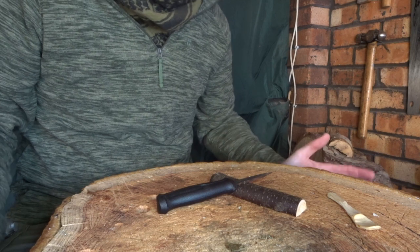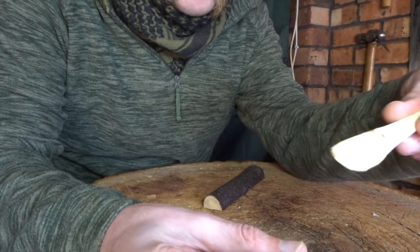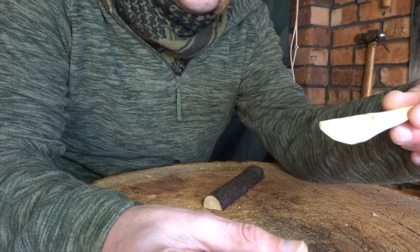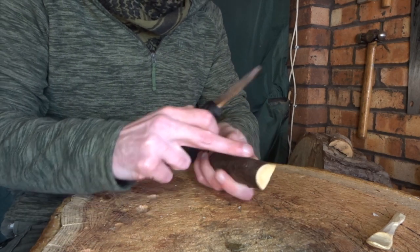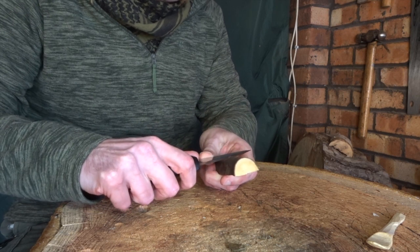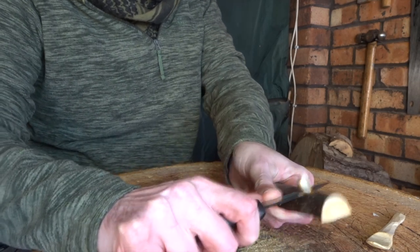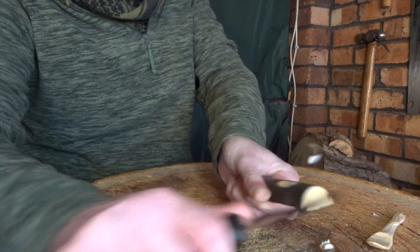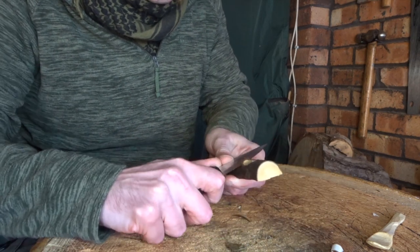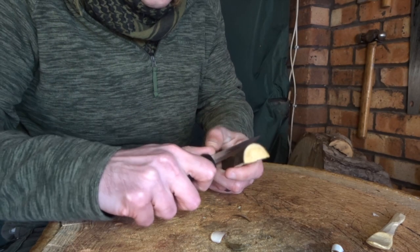Let me move the camera just a bit closer in and we'll make a start. The first thing I want to do is put in the spoon bowl. This is a little bit easier — it's not quite the nicest of spoon bowls, not quite as detailed or as deep as others you've seen me make, but it will suffice. Going from the top of the rounded part of this half branch, I'm just going to start putting in a few little cuts and you'll see it's starting to put a little indentation in. Don't worry about the far end which looks untidy — we'll come back to that. I'm using this nice rounded section here for the bowl.